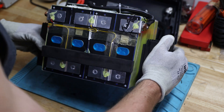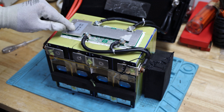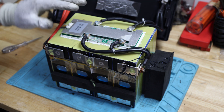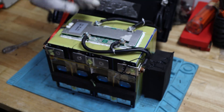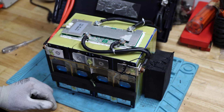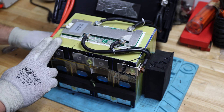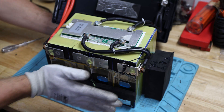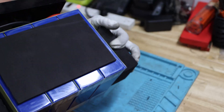It's a typical Chinese solid build and it's perfectly fine. They used a little glue to keep the balance leads from getting loose. I'm surprised they have a good-sized wire for the 150 amp capacity. It's a 100 amp rated BMS — it says that right on it — so it's interesting they label it 110 in the marketing. There's no Bluetooth, by the way. It doesn't feel loose, but some torque marks would be appreciated.